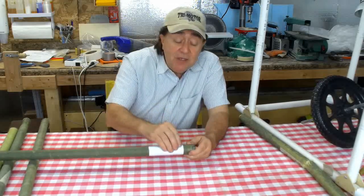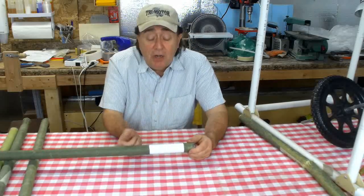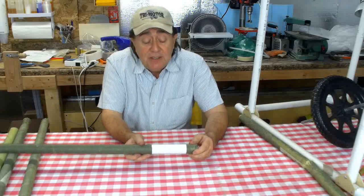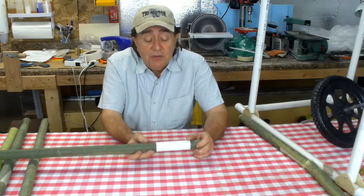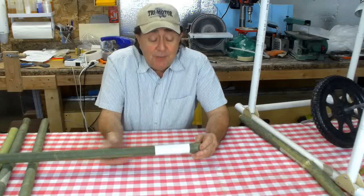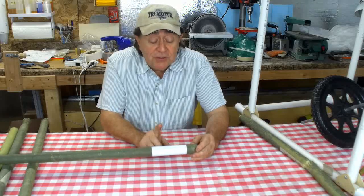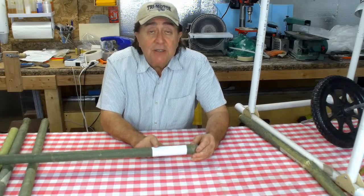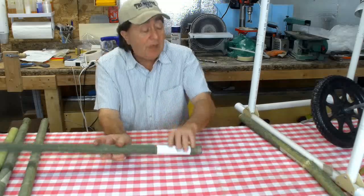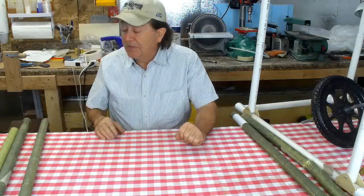And you can get a hold of an edge and put some solvent in here, like Goo Gone, and take it off. So maybe seasonally, during the winter, if you live in a cold climate, you sit inside and you redo your tubing, put new coating on it. But I think this is, for a home builder, a great answer. I think it's actually superior to paint. So I'm going to be using that on the tubing to keep the sun off.